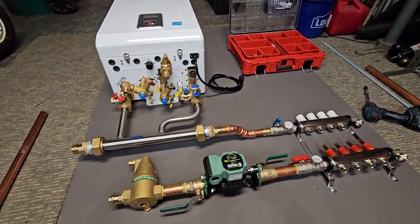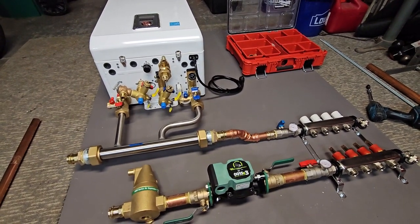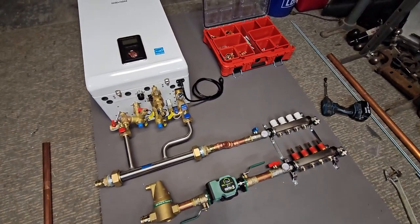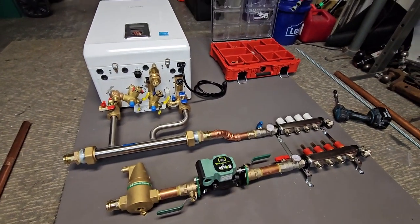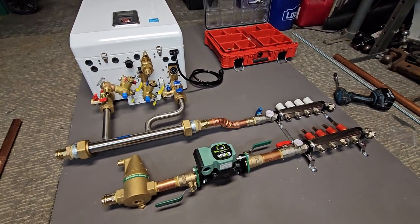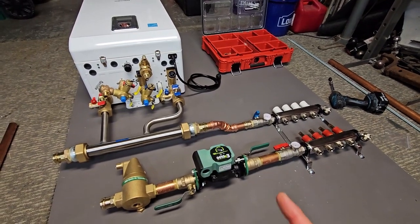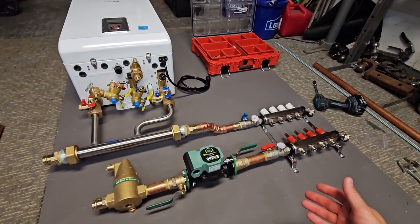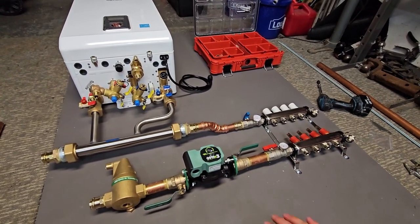The price difference matters a lot more when you have multiple zones. These Navion boilers can do up to three zones internally on the combi models. The heat-only models can only do one zone without an external zone controller. So if someone tells me they don't need domestic hot water but they want two or three zones, I always tell them: if you have any possible need for domestic hot water, the most bang for your buck is the combi, since it handles up to three zones on its own. Above three zones, you'd need to add an external zone controller or switching relay.